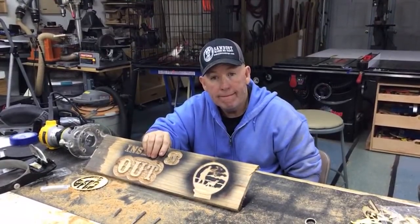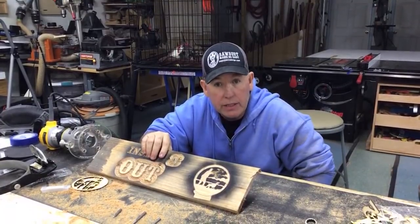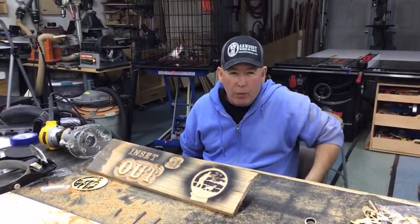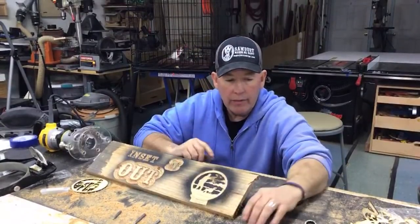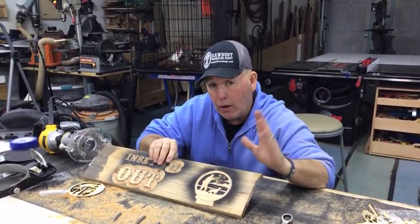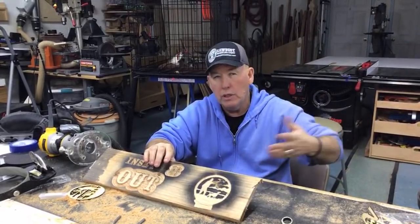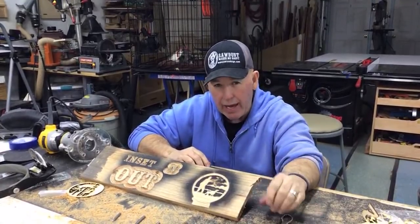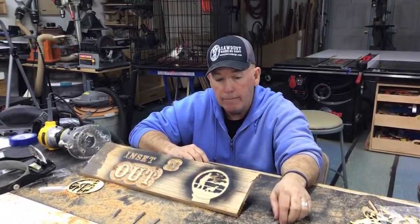Somebody asked about your sanding sealer. What's it called? The sanding sealer I use is Minwax water-based sanding sealer. And you get it where? I buy it at Lowe's in a quart or a gallon. I brush it on, but I use a critter sprayer and spray it on most of the time when I've got multiple boards to do. I don't put that on cedar, I put that only really on pine. I use primarily cedar, pine, redwood, and some other types of woods too, but generally they're live edge. White poplar, I use white poplar, but I don't find I need sanding sealer for that.